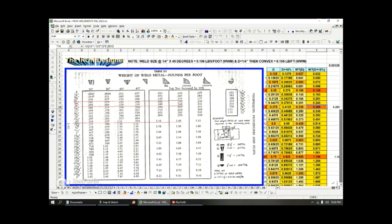With the 3/4 inch weld, probably for like a 1-inch plate, or don't really know, but we're just talking about the weld metal, you get a 0.956 right here. I got 955. Maybe there's some rounding error. And then here, if I rounded this up, it would be 1.16, just like that. So if I took that and just did a roundup, there you go, but I'm going to leave it at three decimal places.